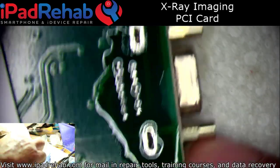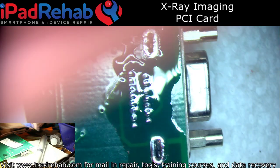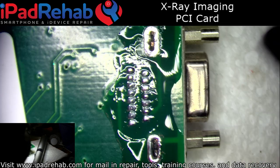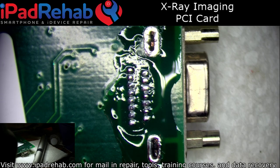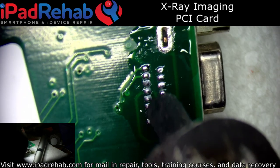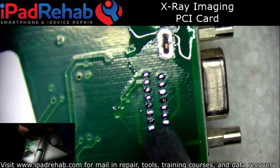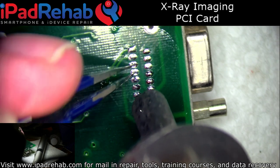So we got those big holes cleared out nice. Now I think I might just give this a little bit of hot air and see if I can just get this old connector to fall right out now that those anchors are done. I'm gonna have to adjust that temperature though. So this is back to the nice big component through-hole days. And soldering was so much simpler back then. I didn't do it much, but when I had to, it was a lot easier.